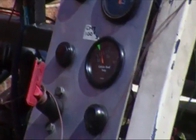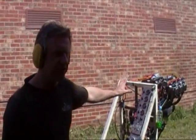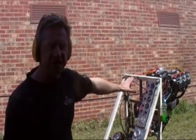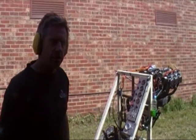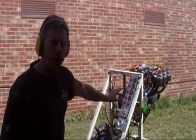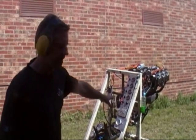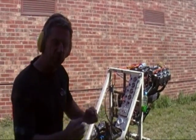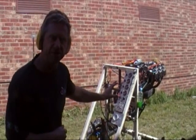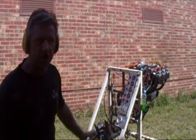Those are fantastic temperatures. Look at the oil temperature — it's around 60. This engine is not using fibreglass ducts, so all the cooling is purely in the water and the air coming over the cylinders off the prop wash. If you had run this test on a Jabiru aircraft with standard heads, it would have overheated well and truly by now. I can run this engine all day long at wide open throttle and not overheat the cylinder heads, because the efficiency of the cooling is so great that it's pulling all the heat out of the engine. It's running at temperatures that we believe give the Rotax 912 its excellent reliability.